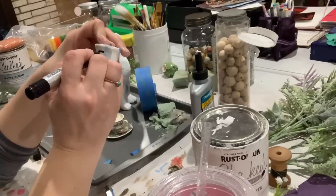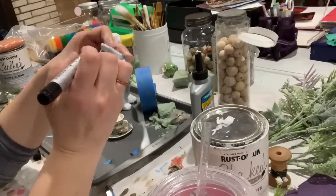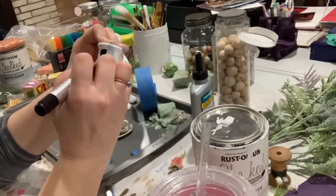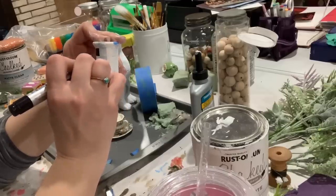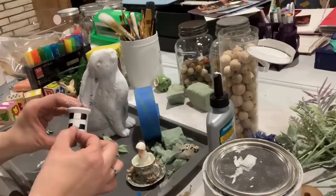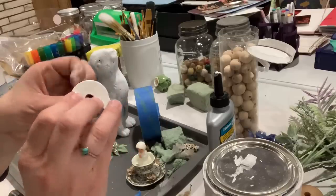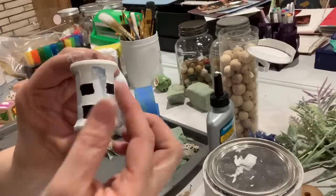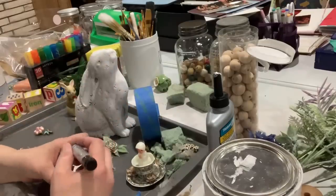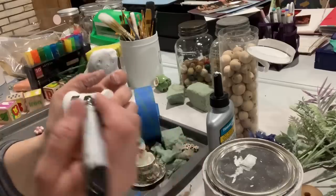I gave the entire thing another coat of chalk paint over the tape to seal it off — you can do the same thing with a stencil. Using the background color seals it, and then you use the color you want the exposed areas to be. This way when you pull the tape off you get very clean lines and the paint doesn't bleed underneath. Then I used my Arteza black acrylic paint marker to create little squares between the strips of tape, about a quarter to a half inch apart from each other. When I pulled the tape off, the squares had very clean lines, and there were also guidelines left behind from that extra coat of paint, which made it much easier to color in the rest of the squares.